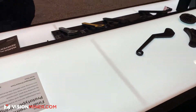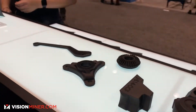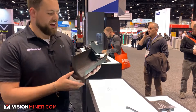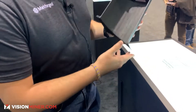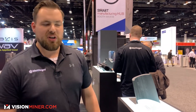We do have six composite machines, ranging three desktop and three industrial — we have the industrial machine here. These are some cool applications we're working with that we can now use for aerospace-grade parts. Our Onyx FR is a flame-retardant version of Onyx — it is a V-0 rated UL-94 blue card certified material, satisfying the 10-second and 20-second burn tests.